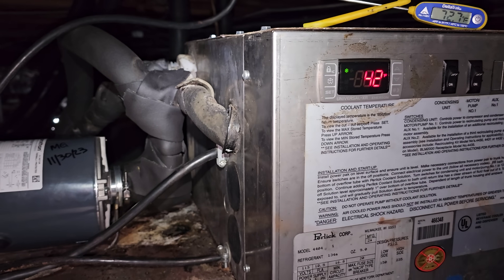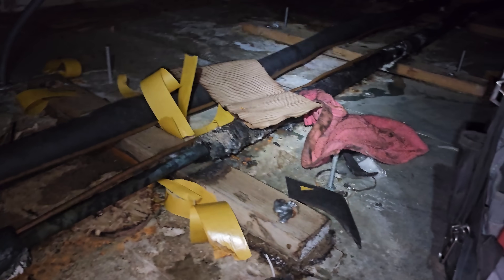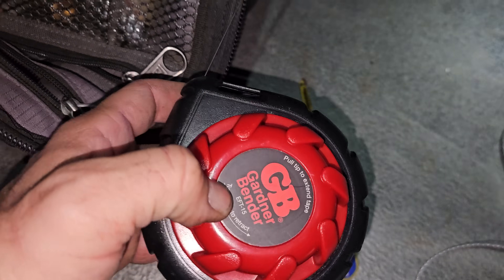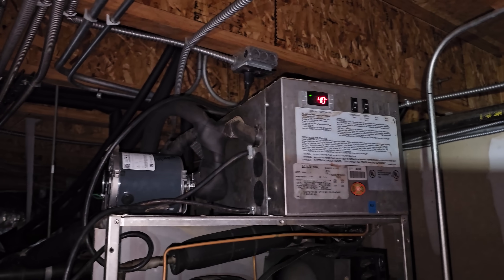All they've got to do is clear all the warm beer out of the lines and this temperature will drop significantly. I'm going to go ahead and clean up some of this stuff and organize this attic — clean up everybody's trash. I found a retractable fish tape that someone left up here — I'll throw that in my van. I cleaned it up a little bit. Glycol unit's at 40 degrees — it'll take a little while to get down to the 28 degree set point. My office just keeps getting dirtier and dirtier. I've got too many compressors stacked up — this is turning into Dexter's laboratory.